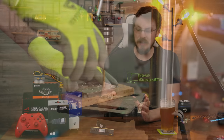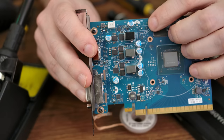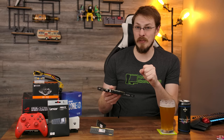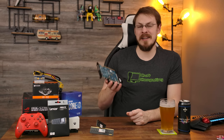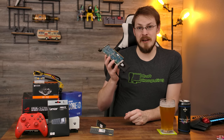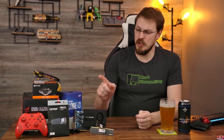I did have a couple of components on this board that I had to fix in order to make this heatsink fit. Number one is this crystal oscillator — it used to reside on the front side of the PCB. There was also a capacitor that got in the way of the heatsink that I ended up drilling a hole for. However, the hole still wasn't quite enough to get the capacitor all the way through, and I ended up breaking the leg off the capacitor. I thought that capacitor was going to be the reason the card ended up not posting. However, it actually ended up being the crystal oscillator — it came delaminated on the inside, meaning it no longer had electrical connectivity from one leg to the other. A brand new crystal oscillator installed in place and the card fired right up. As for the capacitor, I just cut it off, and it works just fine. As soon as the PC is together today, we'll get into some temperature and performance testing on the GTX 1650.